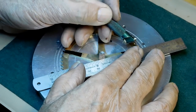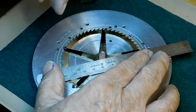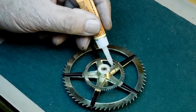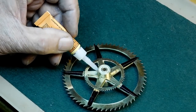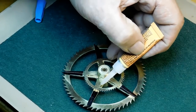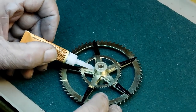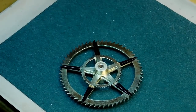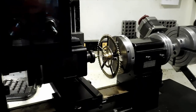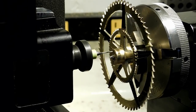We just mark them in that blue section — we want to be able to line up the tip of the tooth on the small wheel to match the tip on the large wheel. Once they're all lined up, I use a little super glue — capillary action finds its way in there. That top piece is the washer that goes through the center. With them all held together, we take it back over to the lathe and drill them using the PCB drill, the same way I did in the lantern pinion video.